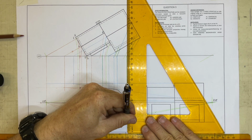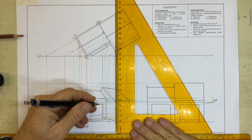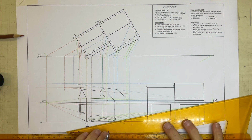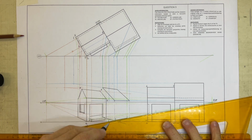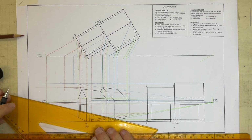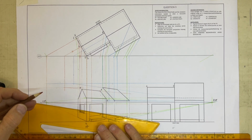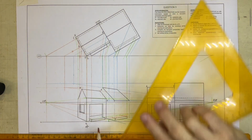And then remember the center lines that we see on here. We get two types on here. We get the sewage line, that's a center line, and then the building line is also a center line. How do we know the difference between the two? One is always a little bit thicker, but if you can't see it on the page, the one with the manhole and the IE and the RE on it, that's my sewage line. The other one will have the BL on it, the building line. That's how you get the difference between the two.